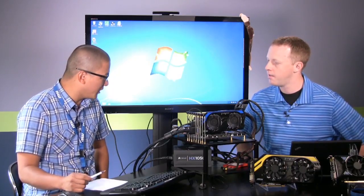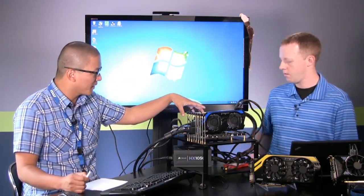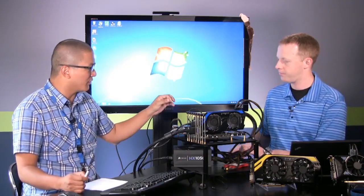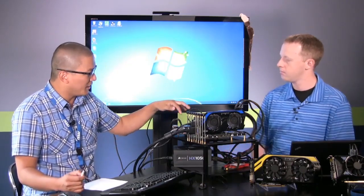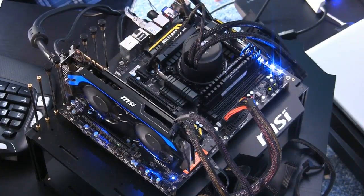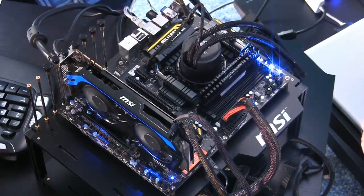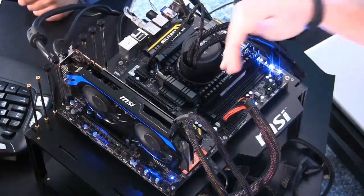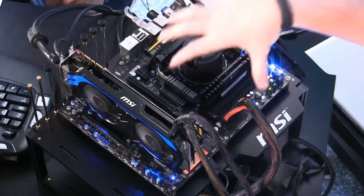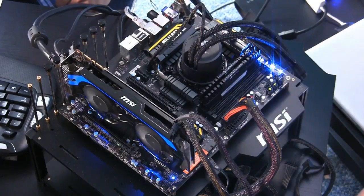That's kind of it. Actually, it wasn't mentioned, but as far as this test configuration is concerned, one of the other things is that the heatsink for the MOSFETs, the power phases, is actually designed for a low airflow condition, such as if you were to run an actual CPU water cooler. So like we were doing right here, if we switch it overhead, there's no airflow in this area at all. The fan behind it is actually blowing away from the motherboard anyway.